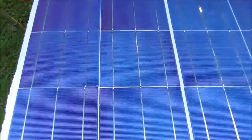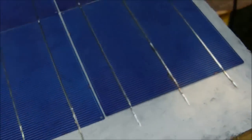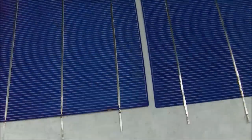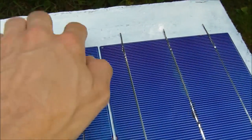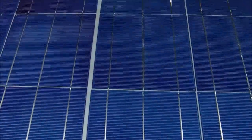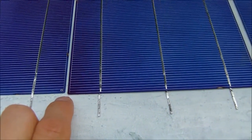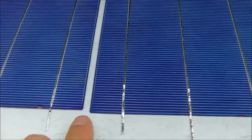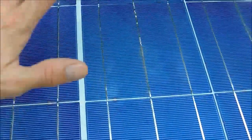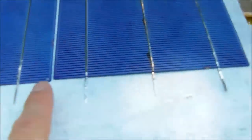I've laid out the rows and you can double check to make sure there's a negative, positive, negative, positive alternating sequence. You have to make sure because when you're soldering these in a series circuit, you're going to be connecting the rows together to continue the series circuit. I've left small gaps between the cell rows just for expansion, and then a larger gap down the center where I'm going to put a little silicone in spots to protect the center of the glass from being pressed down and cracking the cells.